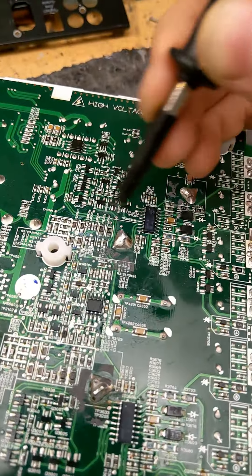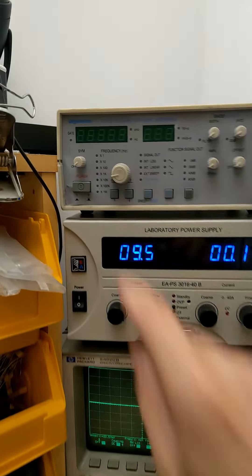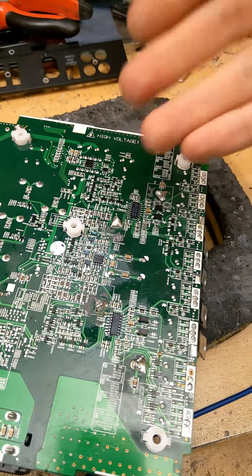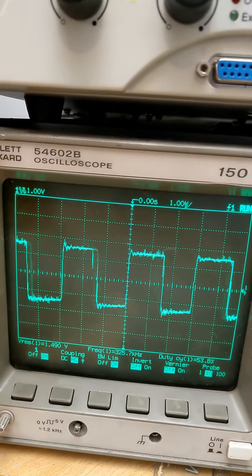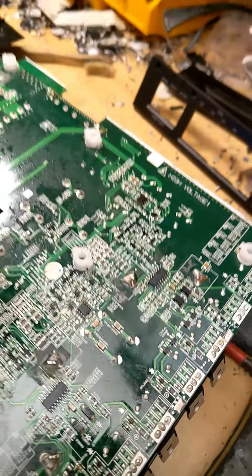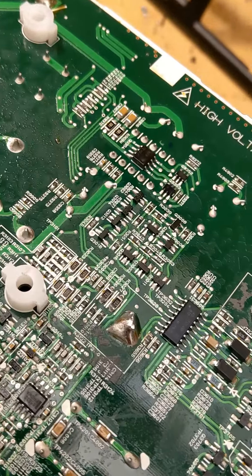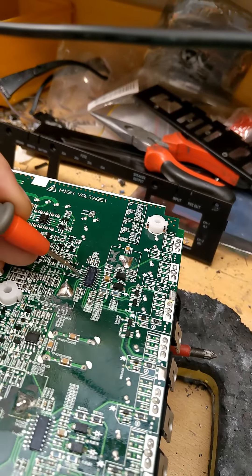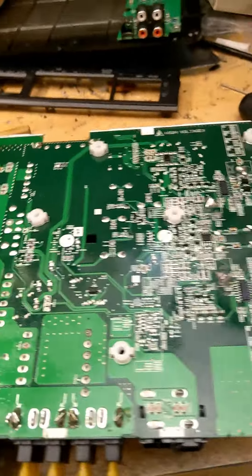This might be a self-oscillating amplifier so we may not get PWM on the input without the outputs oscillating, but let's check anyway. On the working channel, the input to the drive IC is on pin 5 - there's a nice PWM there. Checking pin 5 of the bad channel - absolutely nothing. That doesn't necessarily mean the circuit supplying it is faulty. We can use the multimeter to confirm there's no low resistance on the input pin to ground on this chip: good channel climbs to 833, bad channel shows exactly the same - so it's definitely not being pulled down internally.